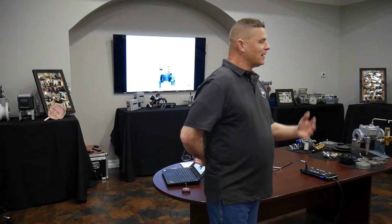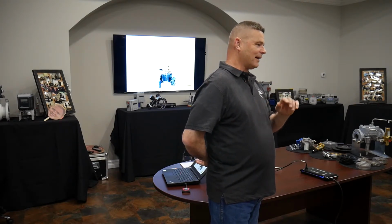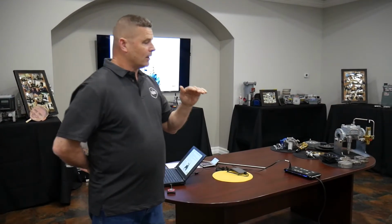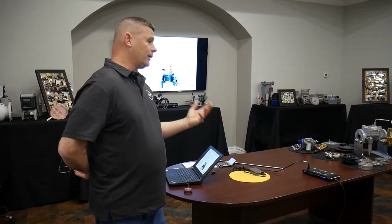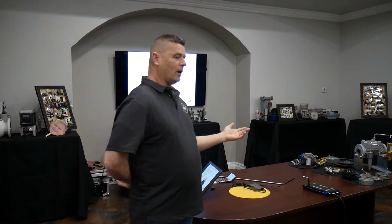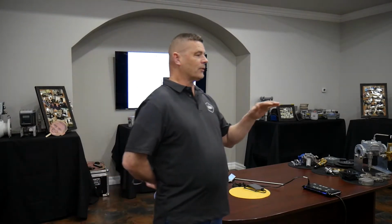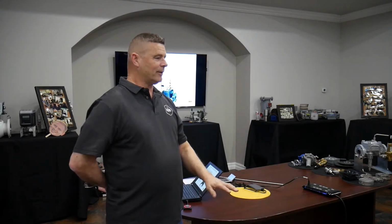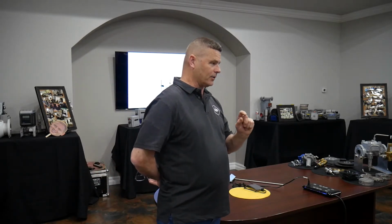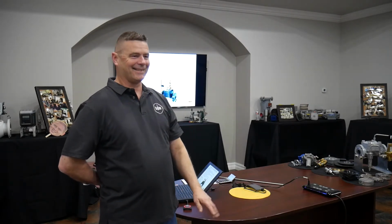Excellent. Thank you. Okay, so I appreciate these things where I may not describe it well enough and I need to go into greater detail, because it's a simple thing to think about. Find the maximum pressure. When you understand what the turn down is based on the throttle plate you've put in, you just divide by that number. So if I say that turn down is 300 to 1 and the maximum capacity at a certain inlet pressure was 300,000, then at about 1,000 cubic feet an hour, that regulator starts lowering its ability to have fine control over the gas. So it can go from 300,000 to 1,000. Okay. All right.